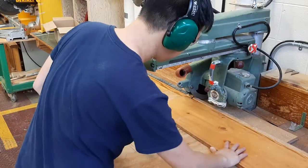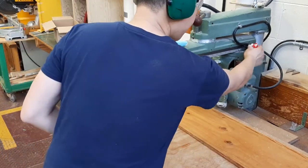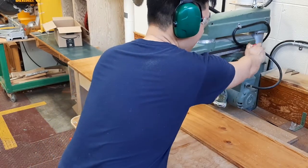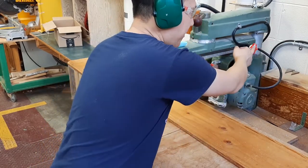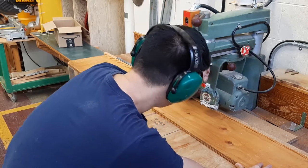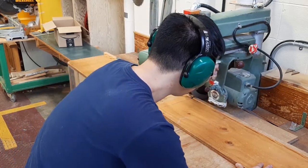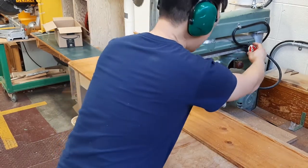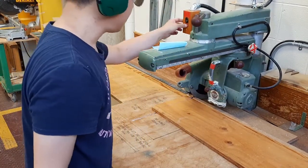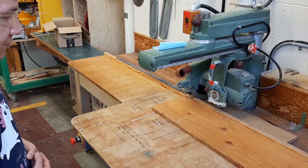Let's see it the other way. This time I'm going to hold it like this and use my left hand to hold it from this side. Again, make sure the carriage is locked, turn it on, keep your left hand on the carriage, unlock the handle. Now that the carriage is unlocked my hand is effectively glued to the handle — make your cut. Then lock the knob, confirm the carriage isn't going anywhere, let go, turn it off, and wait for the blade to stop spinning. That's how you do one-off cuts.